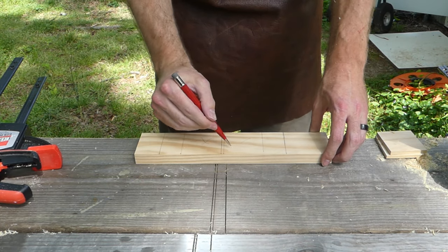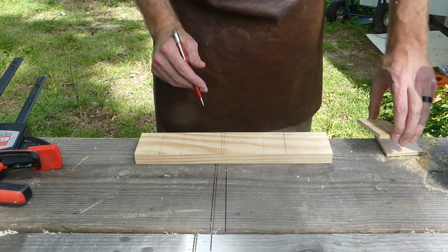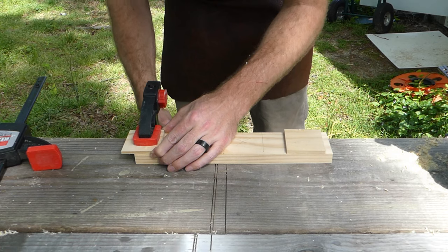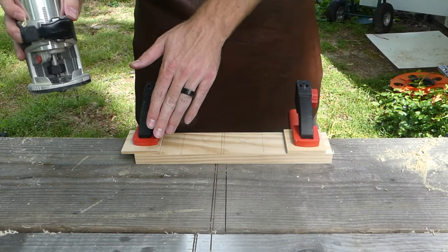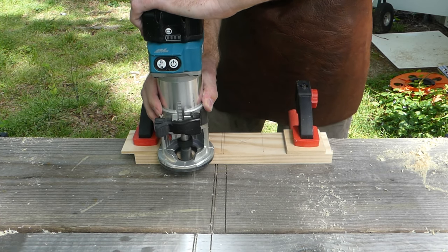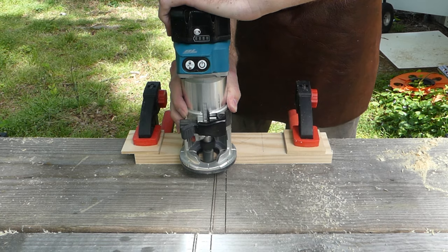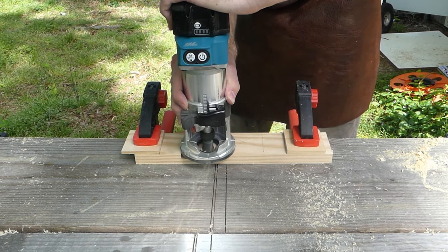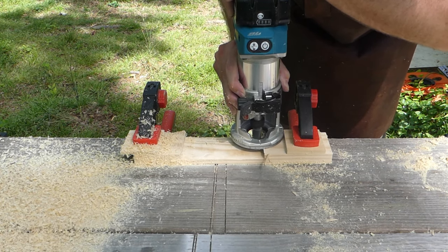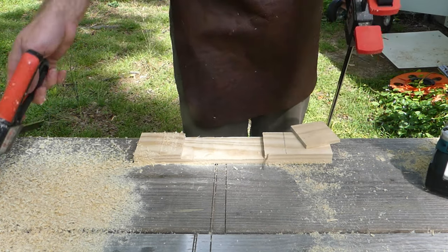For the router, I'll show you how I cut out two sections and leave a space in the middle so I can go back with a miter saw and cut it in half. I also marked out where a spacer needs to be so when the router hits the edge it stops and doesn't cut farther than needed. I set these little stop blocks in place, clamp it down, and make sure my work surface is ready. I'm going to use the router in only one direction — if you go left to right and back and all over, the router won't be set against the surface and you'll start plunging. Keep working against the surface you already have, make sure the router is flat, make a bunch of straight passes all in the same direction, and when you get that last cut it should look pretty good. You may have a little tear out to clean up, but otherwise it looks good.